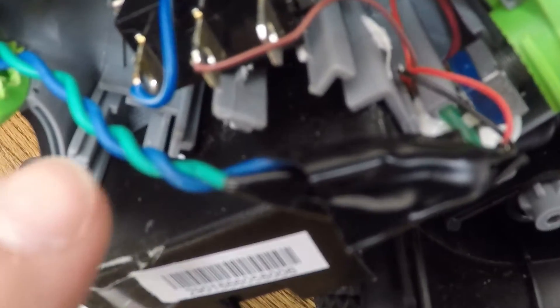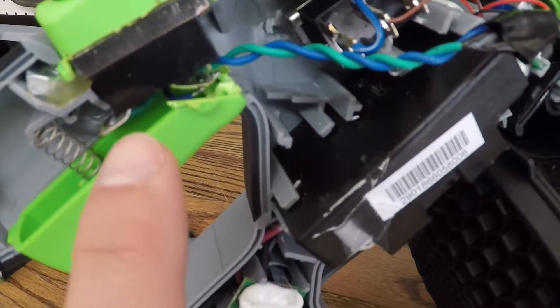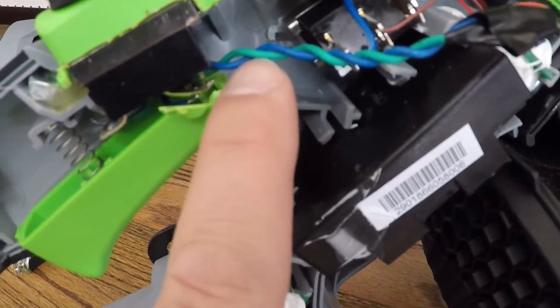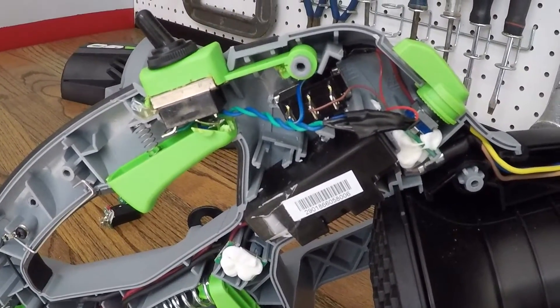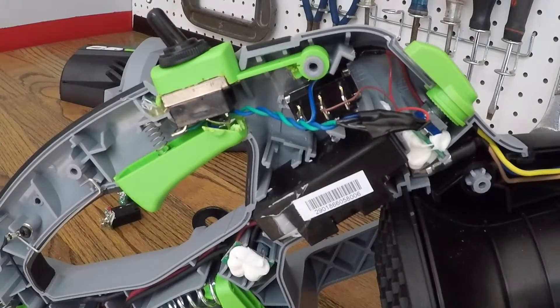The red and black wire in the front is soldered and taped to the blue and green wires that go to the turbo button on top. You had to bend the contacts to allow the stock trigger to fit. The switches have three connectors: a common, a normally open, and a normally closed. In this case we're not using the normally closed connector, so we just cut that terminal off completely. We're using the normally open and the common contact.